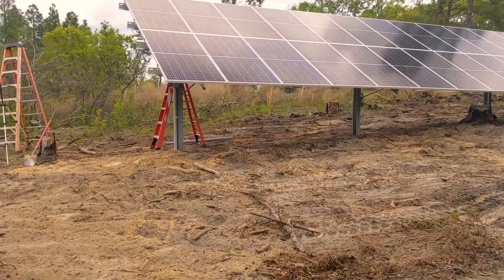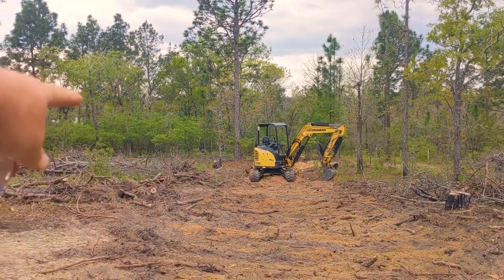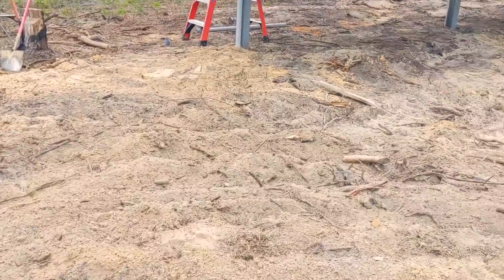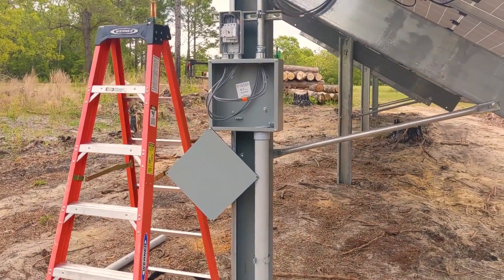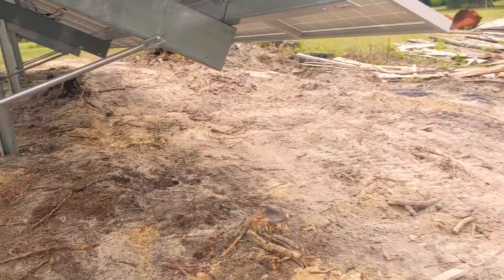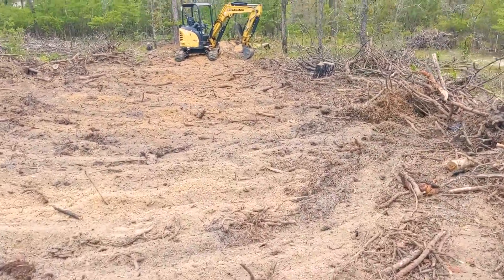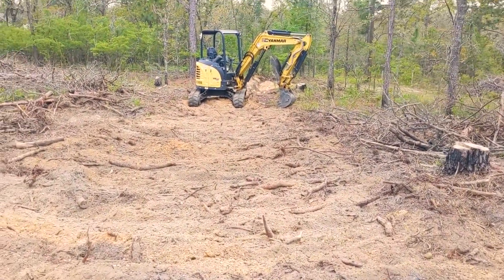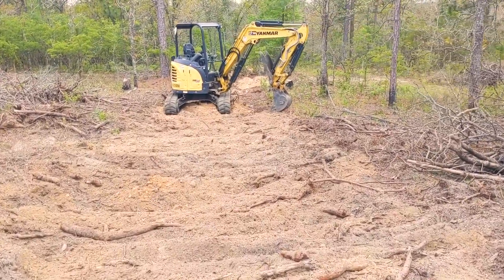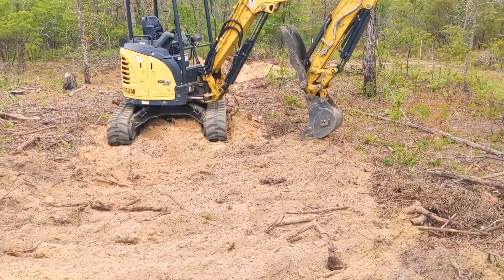Day three — wrapping up the electrical build, getting the conduit run. We're 600 feet and I just need to get way down to the first pull box and then come back and button this up. We're sitting at 307 volts on our strings. I've got to get the trench backfilled and tamped. I always keep my track in the trench to keep it tamped so when you come back next year you don't find the trench. We put trenching tape in above our conduit.